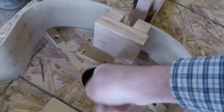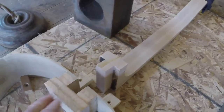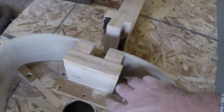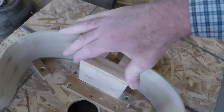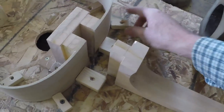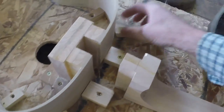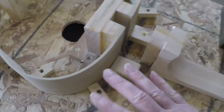This is so efficient to have — this is stuff you throw away. I have a really hard time throwing wood away anymore. I drilled this hole so I was able to reach that clamp right down underneath this block and clamp it down tightly. Then with my bunch of junk blocks I corralled this piece to hold it really tightly where I wanted it, and clamped it where I needed to. You'll notice there's some space there, and there's even a little bit of space there — which is fine.